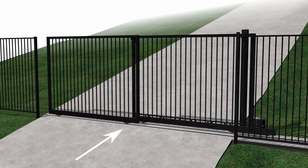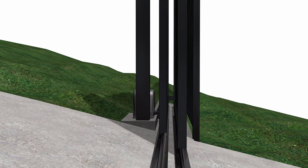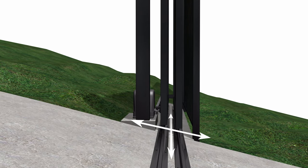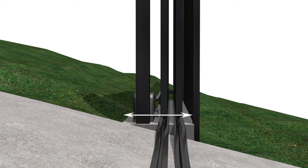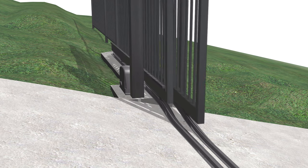Slope from the direction of the road has little effect, so long as the footing has the same slope as the driveway in both directions. The motor pad must be level and at a height that allows water to run around it, yet not too high otherwise it might not line up with the bottom of the gate. A common mistake is to make the second half of the footing level so the track needs to rise up a step — but this does not work.